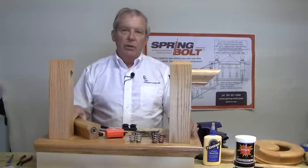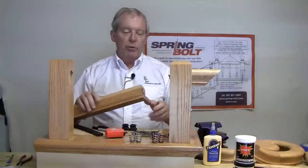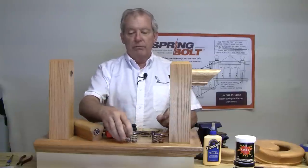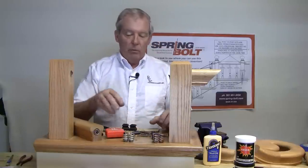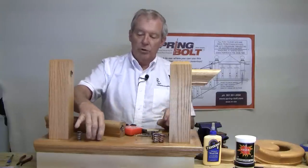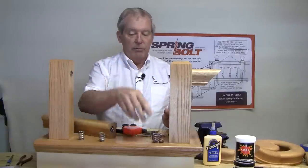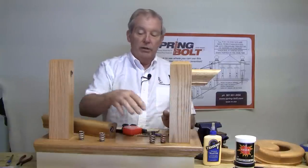Hello, my name is Roger Rock and in this video I'm going to be giving you some installation tips on our rail to end post kit. The rail to end post kit is used for attaching a rail in between two posts. In each kit you'll receive a pair of mill finish springs and a pair of springs which have a little bit of red paint on them. The pair of mill finish springs go at one end of the rail — one spring goes into the post and the other spring attaches inside the hole on the end of the rail, and the same is true on the other end. You'll have your red springs in the post and in the rail on that end.